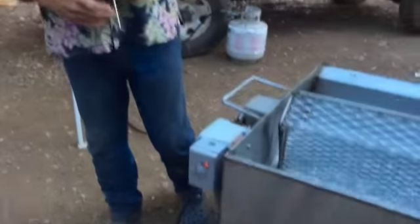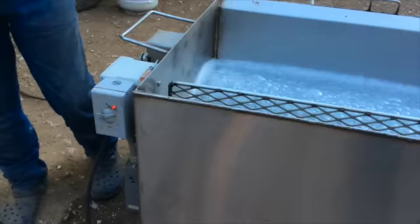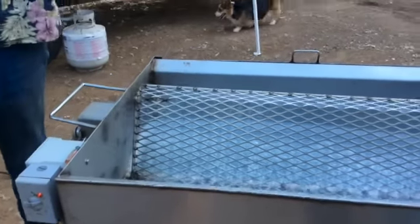How long does it take to fill with water? We bring it from inside. This trailer has an insta-hot, and once it's working you can feed this and it will come out at 150 degrees. It's really a great deal. But you have to have one of the tall tanks — the pressure on a small five-gallon tank isn't enough pressure to run the insta-hot. That's the only drawback.